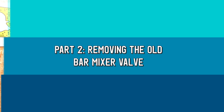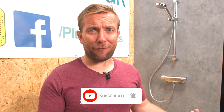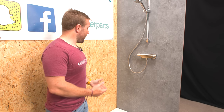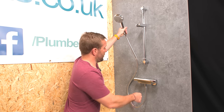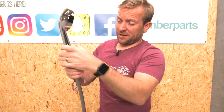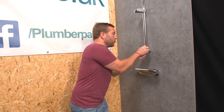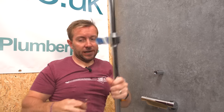Let's get on with installation. The first thing we want to do is turn the hot and cold water feeds off. I'm not gonna show you how to do that in this video because every installation in every house is completely different and you could be scrambling around under the floorboards for hours looking for that valve. Once you've done that, we effectively just dismantle our old shower in the way that you normally would — take off the handset, undo the bottom hose. One thing I'd recommend: when you're taking these out, keep the old rubbers if they're in good nick. Shove them in your toolbox — they'll be handy for later. Then take off the caps and remove the old riser. Easy peasy when you know how.